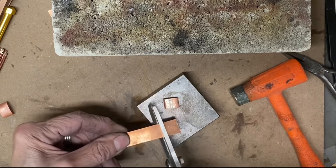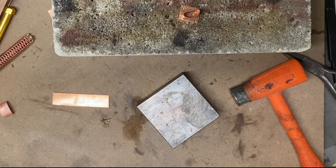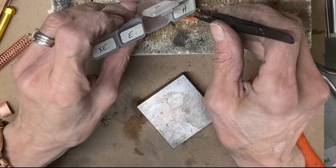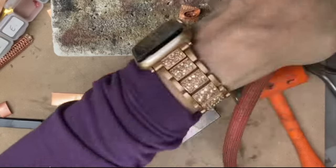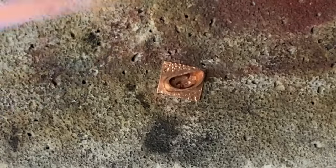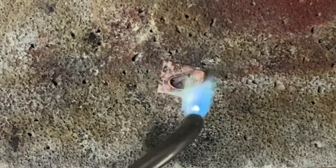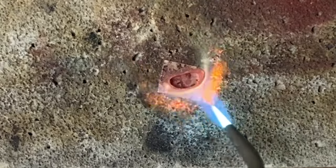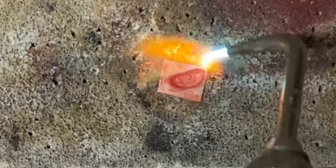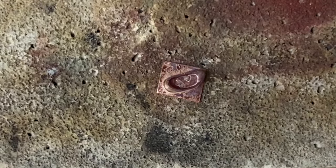Now we are making the end of the end cap out of the same sheet material. I used hard solder on the seam, so now I am using medium solder to attach the end plate to the cap. One of the things I love most about soldering is watching that silver line appear when attaching two pieces together — you can watch that silver line go all the way around. Bring your heat all the way around the base of the end cap so the solder flows and attaches the two pieces together seamlessly.